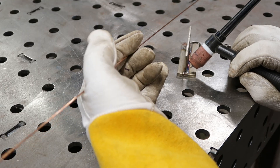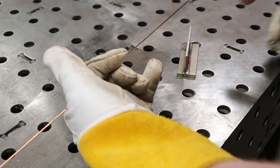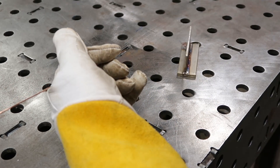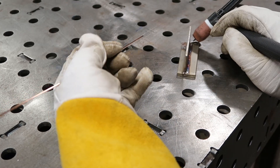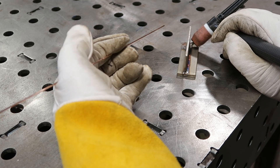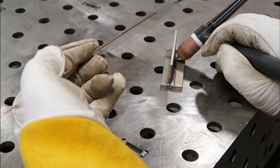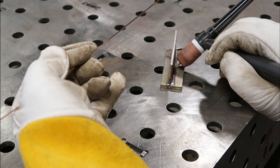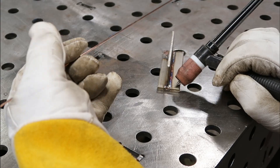It's kind of like patting your head and rubbing your tummy — you're doing multiple functions at once. And this is only two of your functions; you've also got to be running your amperage with your foot. If you can conquer these two first before you throw a third one in, it's going to make things a lot easier. Do this over and over again — pull that torch along as you're feeding the rod, be as consistent as possible.